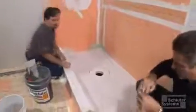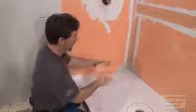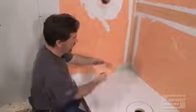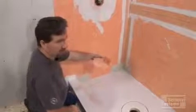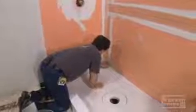Could you hand me an inside corner? These are made to be totally square, but how often do we get to a job site where it's totally square? In case there's any out-of-squareness, I'll put these in first and then my KERDI-BAND is going to cover anything if there's any imperfection in the corner. So the corner goes in first, then the band.